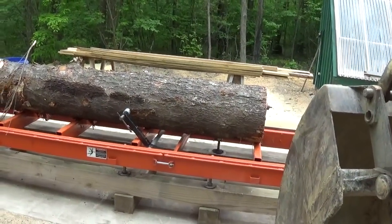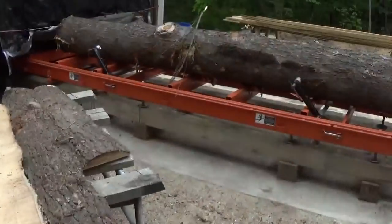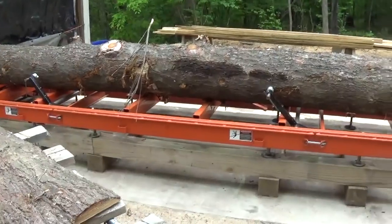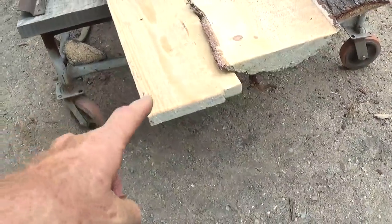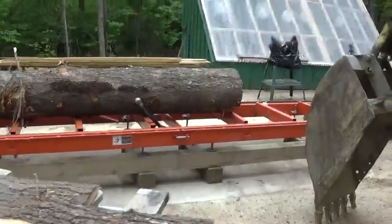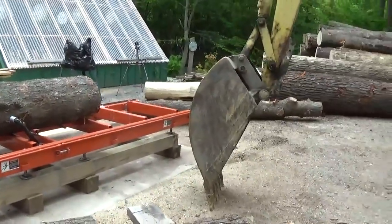I need four more 12-foot 2x4s to put on the rack before I can actually stack the 1x, so I level the pile up. It's okay to put 2x4s and then stack some 1x on it for drying purposes, but you can't mix and match them. Even if you put two of these together, all they'll do is get mold in between them, so can't do that either.